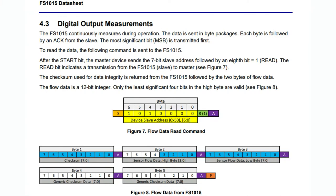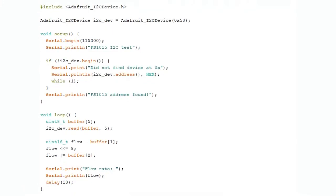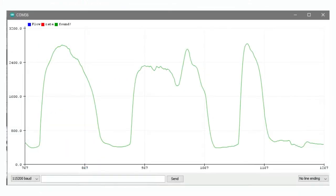The I2C interface is pretty straightforward. You query it on address 50. You get five bytes — three of those bytes are checksum, beginning and end checksum, and there are two bytes in the center that contain the 12 bits of measurement data. So it's pretty straightforward. I whipped up some Arduino code in about 10 minutes and it worked just great. I blew into it and I'll show the demo as well. It increments the numbers and you can plot it very easily. This is me blowing into the sensor while running the Arduino plotter.